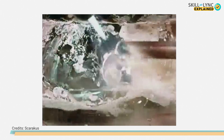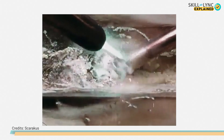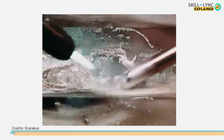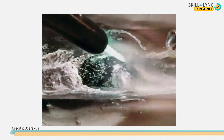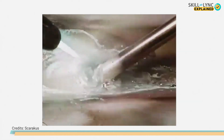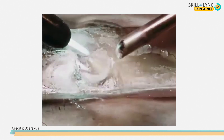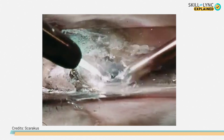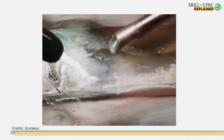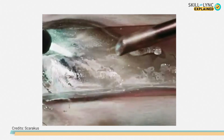The next type of brazing is called braze welding. Braze welding is somewhat similar to gas welding, where a filler material is used to join two or more pieces of material. In gas welding, both the base metal and the filler are melted and then fused together on solidifying. Whereas in braze welding, the joint consists only of filler metal, because the base metal does not melt and is not fused to the joint as in conventional fusion welding processes. Braze welding is most commonly used in repair work of pipes, beams, etc.